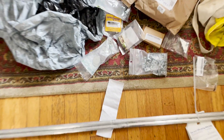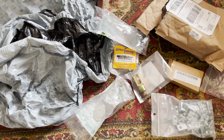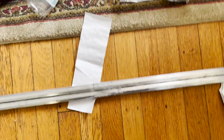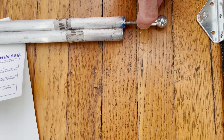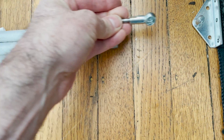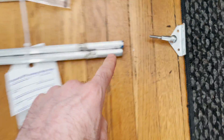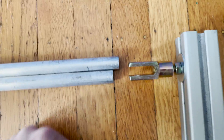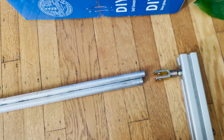It's been a couple of weeks. I've been thinking about how to resolve the issue of the top part of the camper racking when the big heavy door opens. My solution is I'm going to try to create a tie rod, which I'm going to attach to the metal rod by tapping a hole and then screwing this in so that I have an adjustable length. This should snap right in and tie one end all the way over to the other end using a clevis hitch, which will allow me to undo that end and swivel the whole thing upright and use it as support when the camper is open.